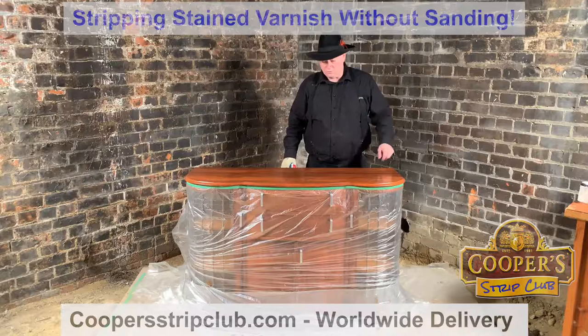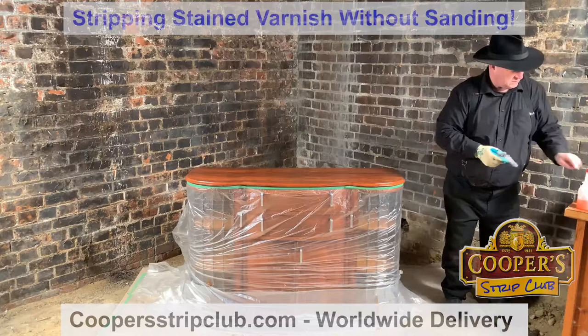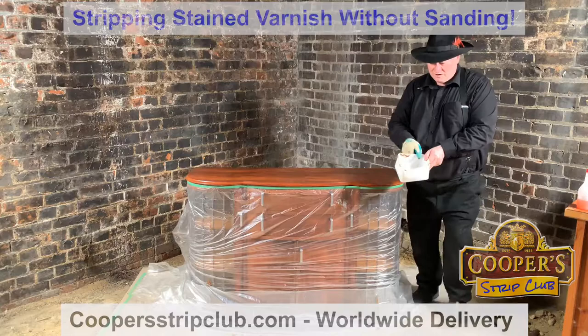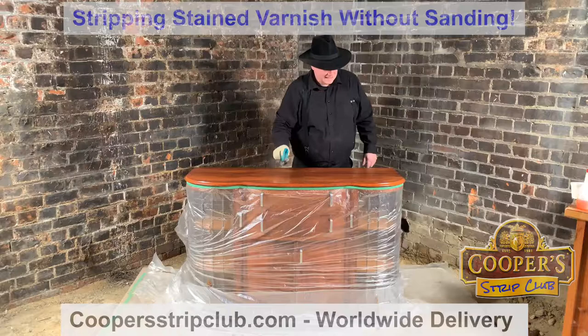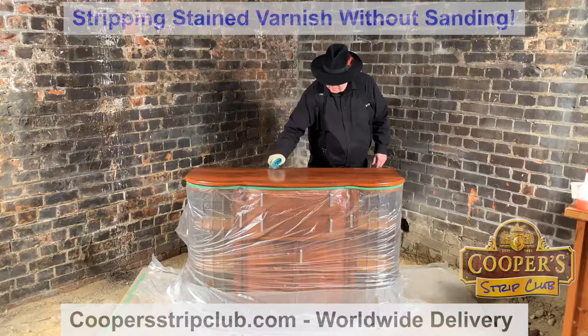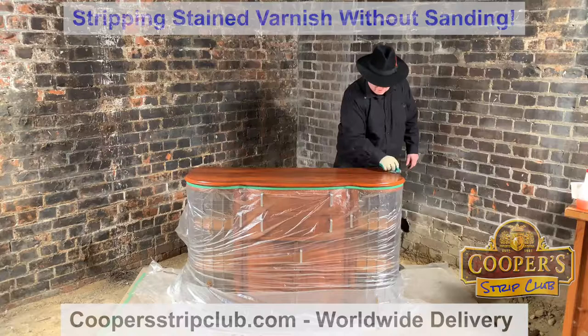It's going to dissolve anything that can be dissolved — varnish, stain — and some of the colour will remain. We'll give it a scrub. There's a lot of finish on the top alone. Other than on end grain, you're always going in the direction of the grain and using it wet so you don't cause any scratches. So you're talking about the surface being wet that we're scrubbing — we're not scrubbing a dry surface.